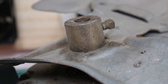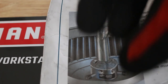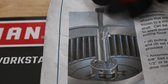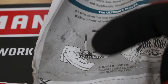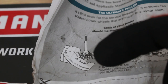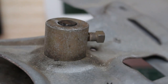In that case it is your best friend to have a blade puller — and different styles of blade pullers in your van. Let me explain the two ways of how this actually works. In style number one, we put this tool around the blade itself, lock it in place with the locking screws, then tighten this part down. As we tighten it down it pushes against the shaft and lifts the blade off. For this style of blade it's a little different — we don't have those little locking screws. We have these little pullers that go underneath the blade, and as we tighten down on the large bolt it pushes against the shaft and pulls the blade out.